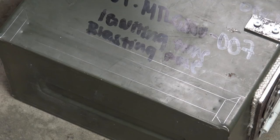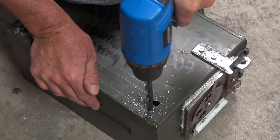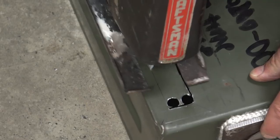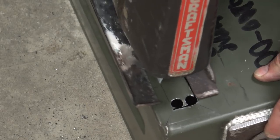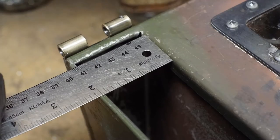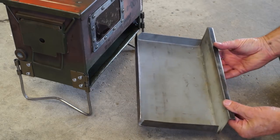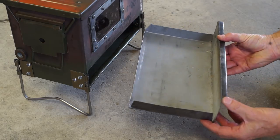For an oven, I marked off a section of the lower side to cut out, allowing for edge material to fold over. I drilled pilot holes and cut out the metal with a metal blade on a jigsaw. The finished opening was just under two inches high. Once bent, the tray required cutting and bending from a 12-inch by 12-inch sheet of 22-gauge steel.